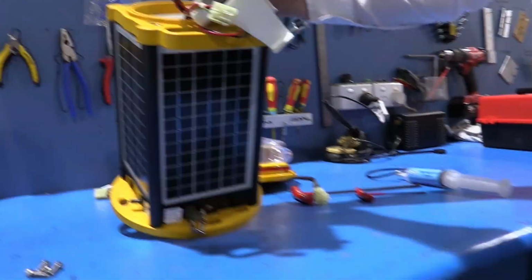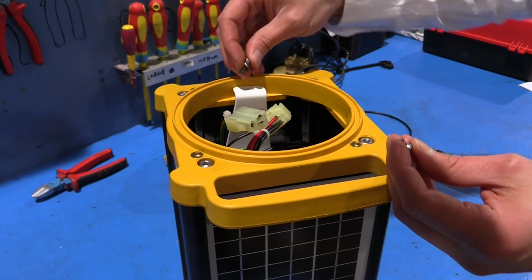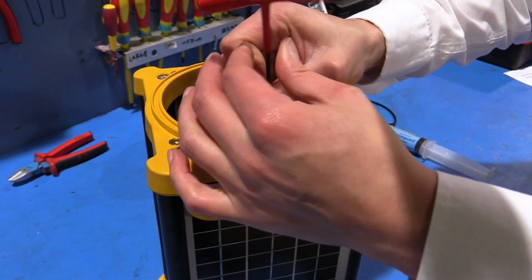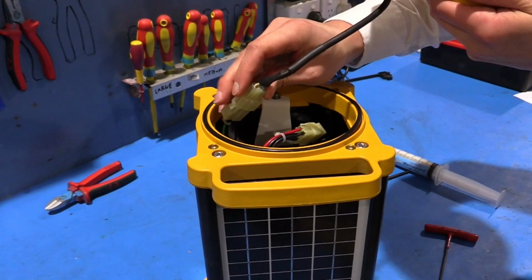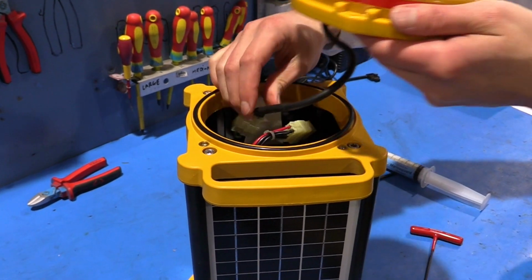Connect the new battery and place the battery pack into the light body and position the upper battery bracket into the top of the chassis. Secure the top of the AV-426 using 2 M2 socket head cap screws and washers. Care must be taken to observe the polarity of each wire before they are connected.